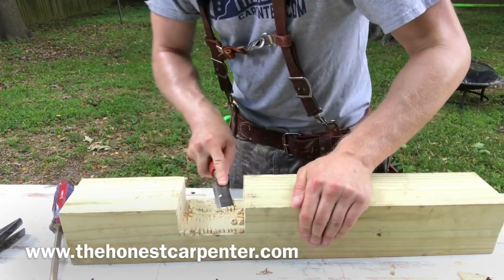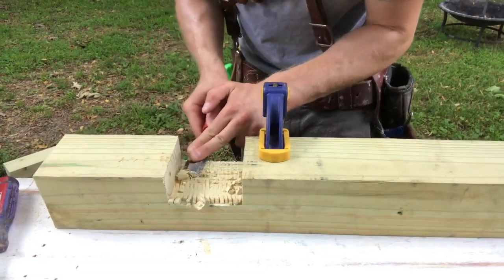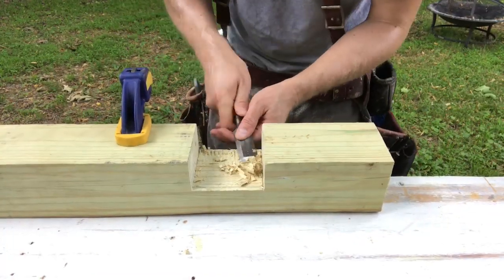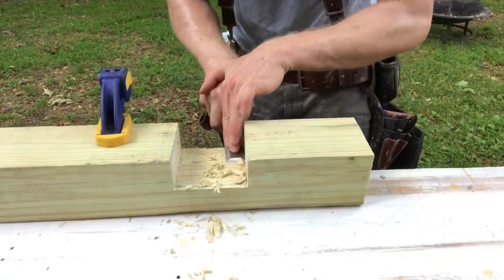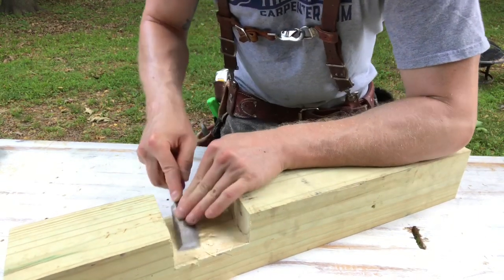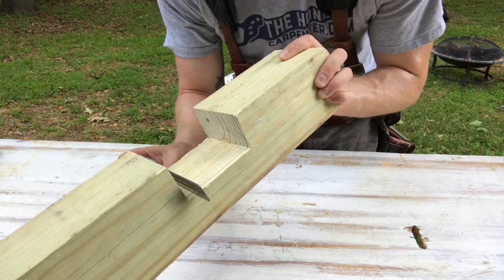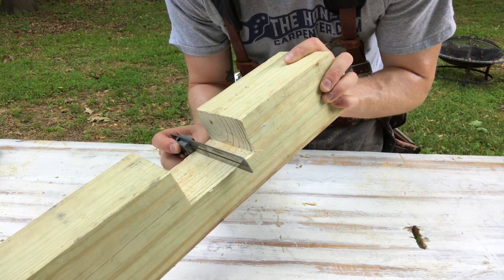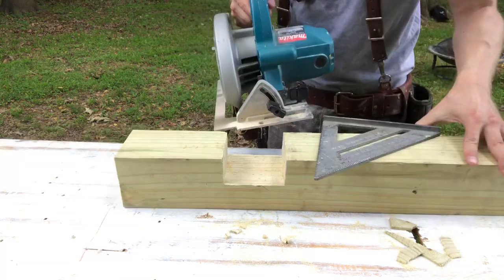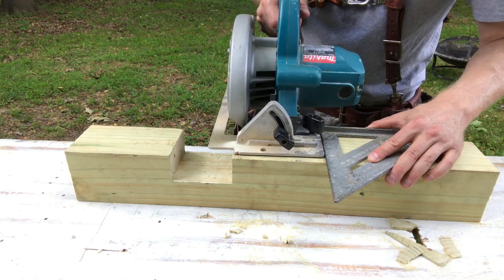With the bevel facing upwards, I begin to push the chisel through the uneven material in a flat, paring motion. It can help to push down on the chisel with two fingers to create a bit more pressure, and you can flip the piece entirely to approach high points from the other side, cutting back towards the center. I've never been that great with a chisel — carpenters don't use them nearly as much as woodworkers do — but this method is pretty forgiving. You can use a combination square to sight high points or unevenness in the floor. You can also test the fit by passing a full piece of stock through it; if it feels too tight, use your speed square to make a saw pass along one of the cheeks of the cut, widening that side out just a bit.